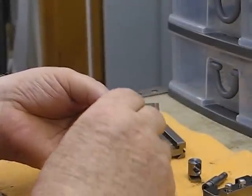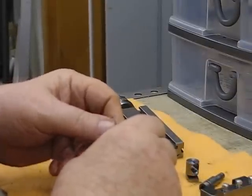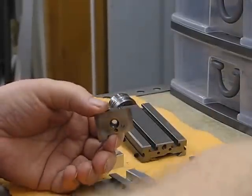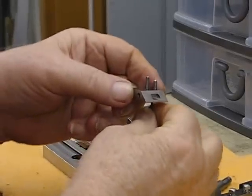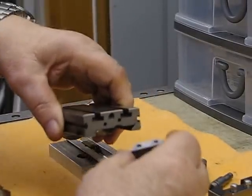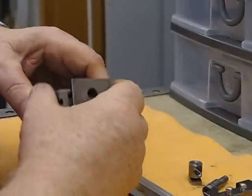I built it around two tapered dowels and one clamping screw — that's all that was required. After thinking about it a while, I thought I'd better make sure I can get this thing off without banging or tapping it and marking it. So I drilled a little hole and threaded it down here, and I have a little set screw that comes through there that ejects or releases the unit away from the front face. The tapered dowels of course allow it to just come out easily.